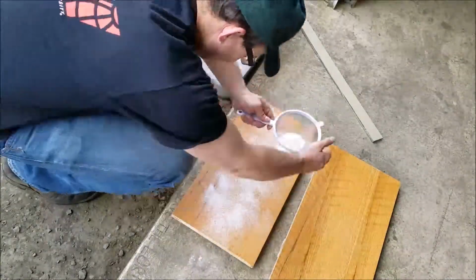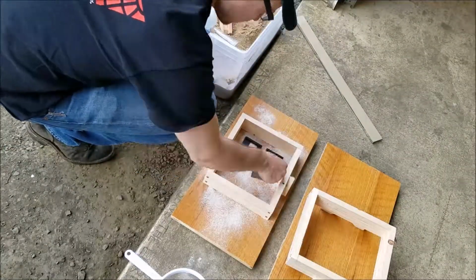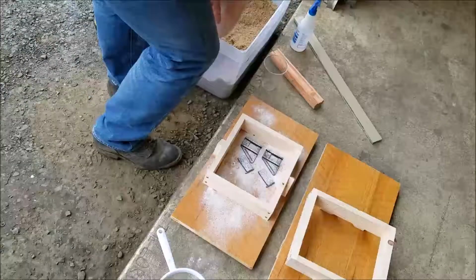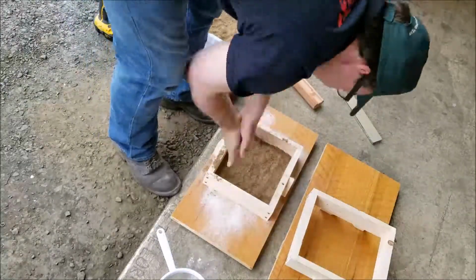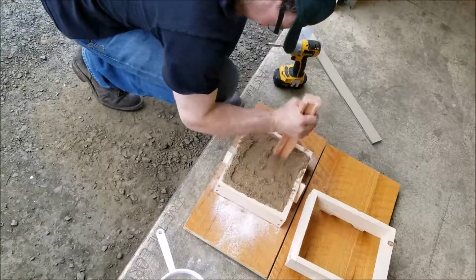Using green sand allows the mold to be pulled apart and the blank removed. The mold halves are then rejoined and the molten aluminum poured into the mold through a channel in the sand. The final precision-shaped features were to be machined into the cast parts.